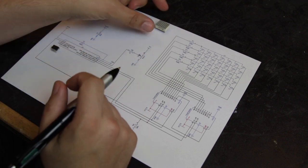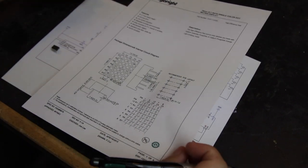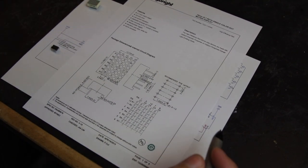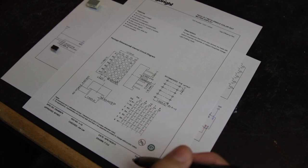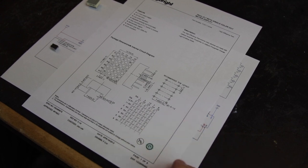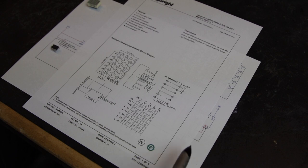These LED matrix displays have for each row or column, depending on the orientation, 5 lines of common cathodes and 7 lines of common anodes. This means that we cannot simply hook up the LED cathode to ground with the current limiting resistor and drive high the anode of the LED we want to light up. We have to drive high the anode line and drive low the cathode line so that they intersect and make the one LED we want to light up.